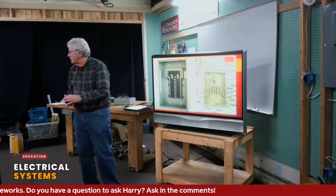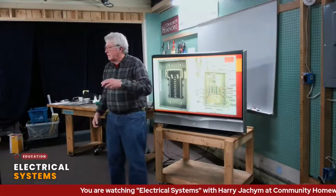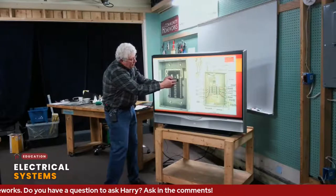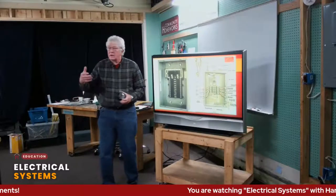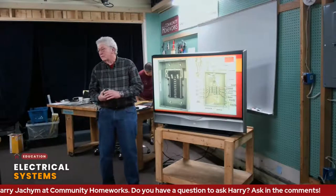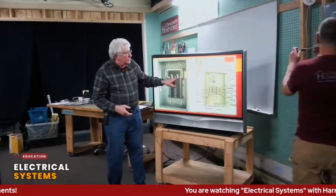The question was: are most things in the house on the 110/120 circuit? Yes — your lighting, TV, and most appliances. For 220, that's a range, dryer, air conditioning condenser, or possibly an electric hot water tank. That 220 breaker takes from both sides of the panel — 110 and 110 coming together at the appliance to apply where it's needed.